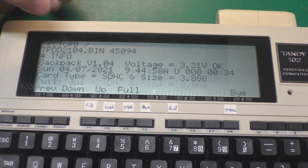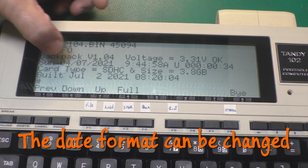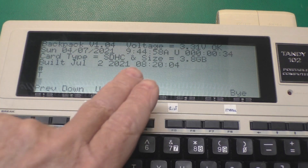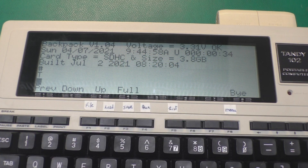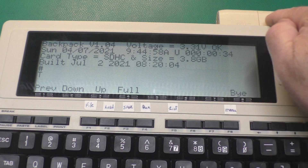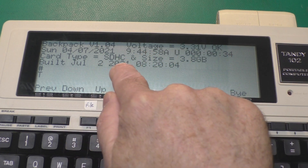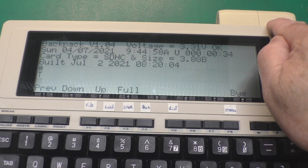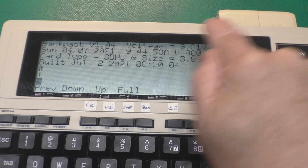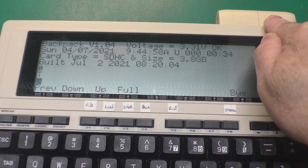The info command is very useful. It'll tell us our firmware version, the voltage — 3.301 volts, which is stepped up from our battery voltage — the day, July 4th 2021, and our time, it's almost 9:45 AM. This particular version of the firmware also has an uptime counter and tells us our type of card and the size. If you get a 'check battery' message, it is detecting that the battery is low enough it may hamper card access — so it's time to replace your battery. If you get a 'check card' message, that means it cannot access the card — either the card is not present or it didn't find sector zero. That sector zero folder needs to be there because it's used as part of this checking process.